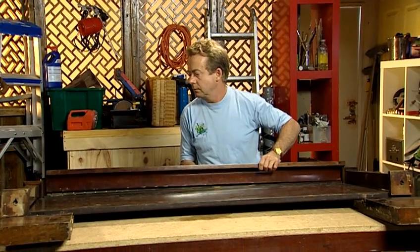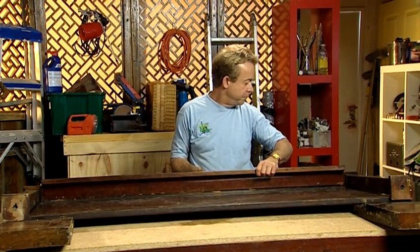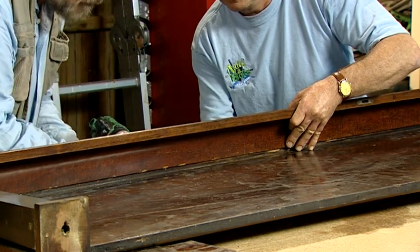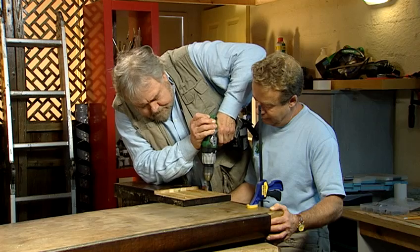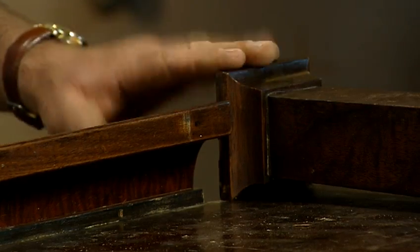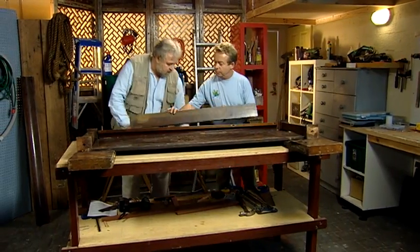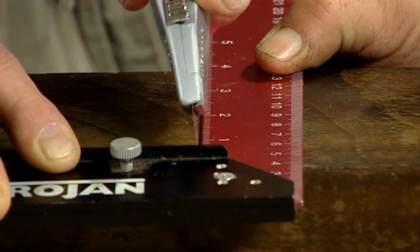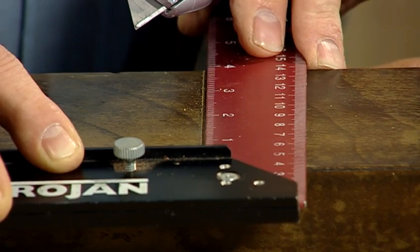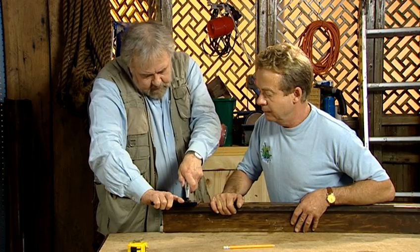Dean's idea is a good one — the keyboard cover fits perfectly between the pillars and the hinge is the ideal way to attach it. Now we need to find something to fit at either end of the headboard to finish off the top of the pillars. The piece we're cutting is from under the keyboard — it's laminated, so to avoid splitting the laminate, Dean cuts the mark with a sharp knife and then two millimetres into the waste side makes another cut. This will ensure a clean finish on the cuts.